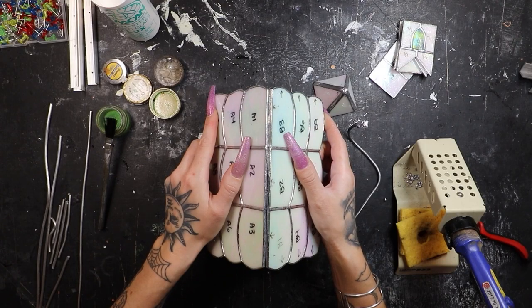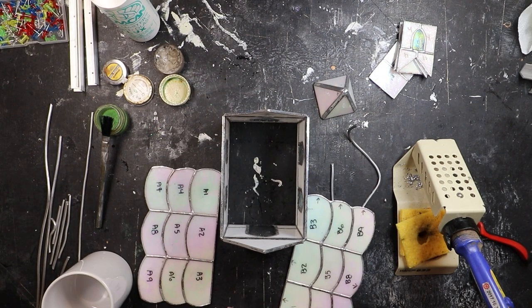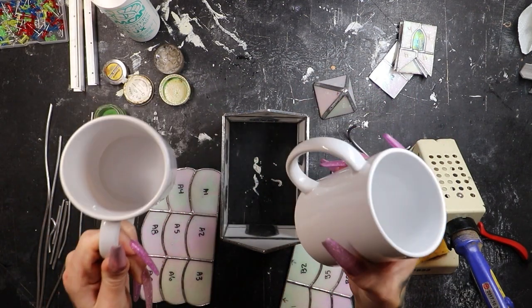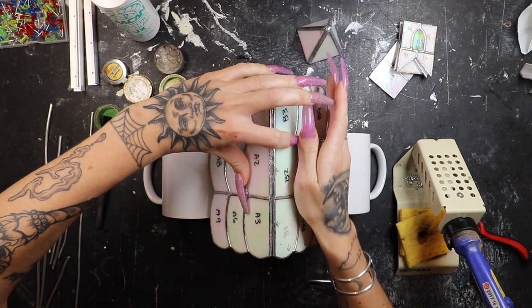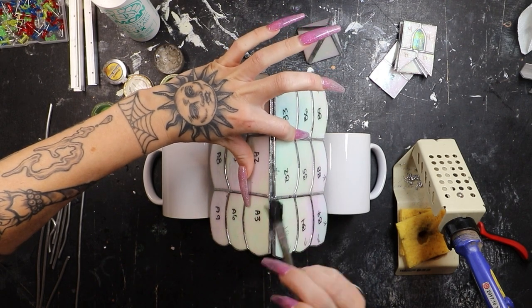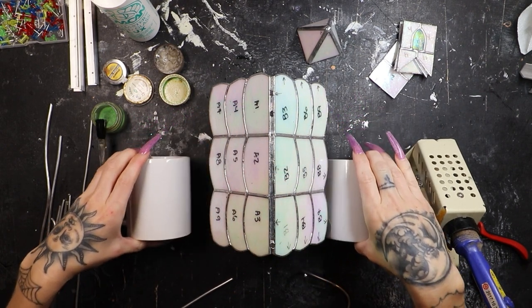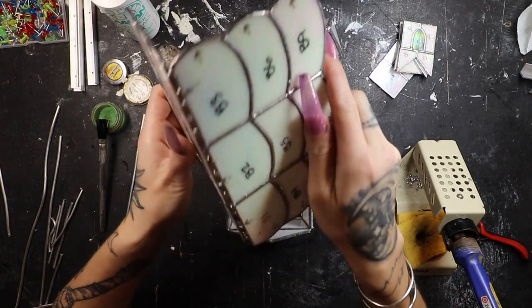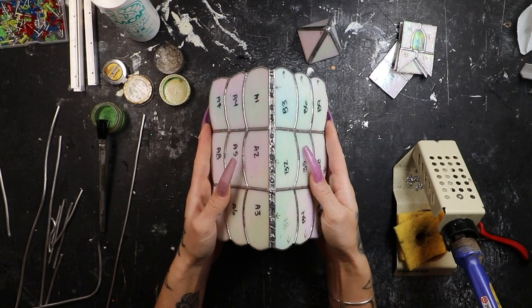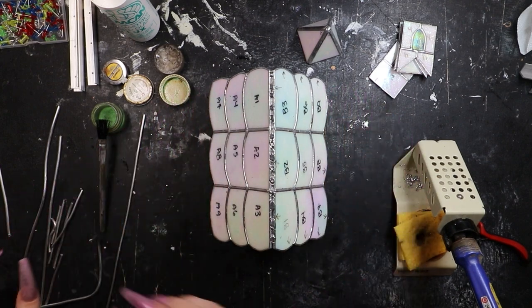We've got to figure out how we're going to hold our roof pieces in place like this and tack solder at the same time. I grabbed two standard mugs — these are actually sublimation mugs — and hopefully these are going to help hold our little roof pieces in place. I'm just going to try to pinch-hold these with my hands. Let me hit it with some flux first, then we'll sit it in the right spot and try to quickly solder them in place. Now we're going to tack solder the ever-living heck out of the top and bottom of this. I feel like I should just bead solder it on top right now, and then we'll go in and solder the inside because it's only a tiny seam on the inside.